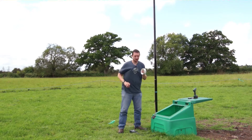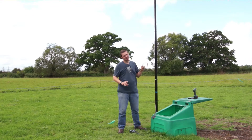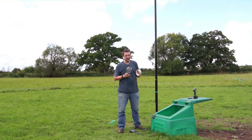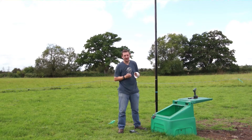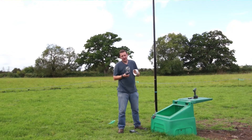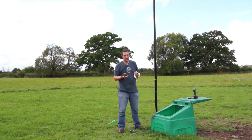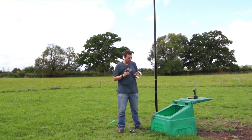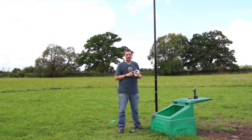So I'm wondering: if I put this coil on the base, can I make this antenna resonate around the 80-meter band — probably around the SSB portion, maybe about 3.7? Now, using a coil does tend to narrow the bandwidth of the antenna, so I'd be amazed if we covered the whole 80-meter band. But if I can get sort of 3.6 up to 3.8 — the SSB portion — I'd be absolutely delighted. So I'll shut the camera off, connect up this coil, and we'll see if we can make an inductance coil out of a piece of air conditioning tubing.